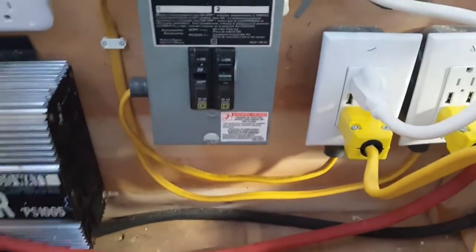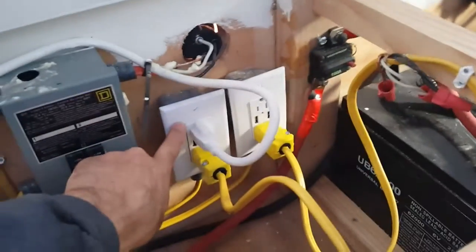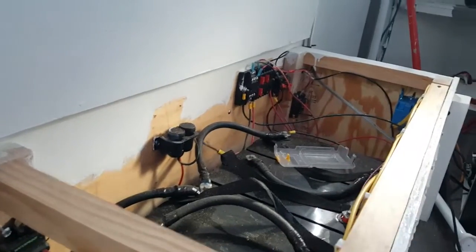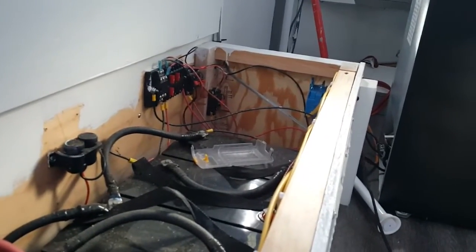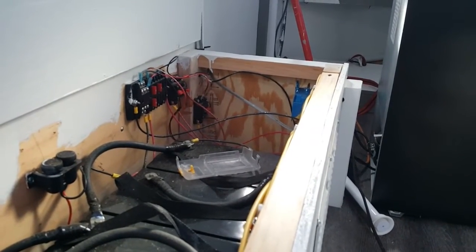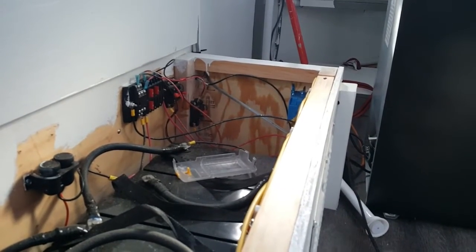The left circuit powers this outlet, the right circuit powers that one. What I'm finding out is that the outlet here and the outlet at the other end of the box are both on the left circuit. That tap right there is where we put in the heater and the air conditioner, and that's going to use quite a bit of juice — a lot of amps. This TV is not going to use a lot of amps necessarily, but I don't really want to add anything else to this circuit because of the load on it.